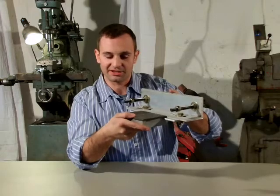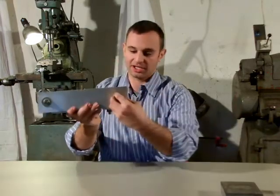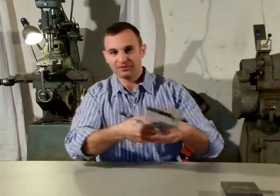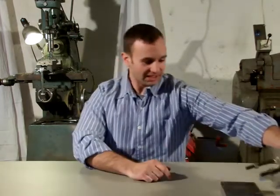As you can see, it stops the mold and locks it in the exact position, so it can't go in either direction. The benefit is that once you have your sprue lined up one time, you set this bracket, which you can adjust, and it moves on the screws back and forth. And these wings move front to back. You can also loosen them up and tighten them up. Once you've got it all set, you just pop your mold back in and it goes in the same exact position for very fast operation and cycle time.